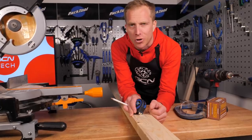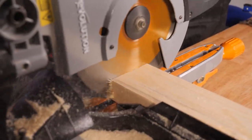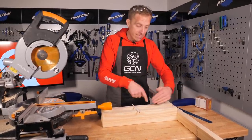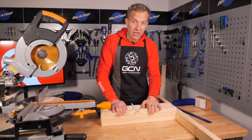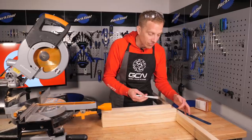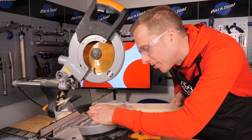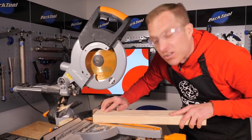Because we've got a chop saw with us, it seems rude not to use it. Now I've got my six wheel supports chopped up - hopefully you can start to see how it's going to take shape. The end board here supports the actual frame, and then the space here is where you're going to put your wheel in between so the bike stands up. There's a noticeable difference in the heights of wood, but for good reason - I want the wheel to be supported nicely from the sides. What I'm going to do is take out some material to a point about 100 millimeters along, so that's a 26 millimeter difference, just tapering it off to make it a little bit nicer to look at. Of course if you're really good with a saw you could even curve that, but I'm not that good with a saw. Point to point it should be fairly easy - sadly I can only cut up to a 45 degree angle otherwise I'd be all over this, but fingers crossed I don't lose the fingers.